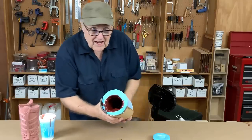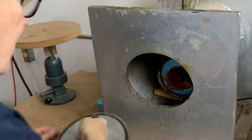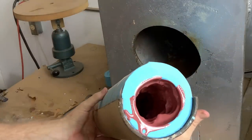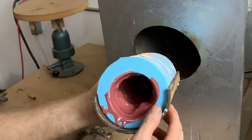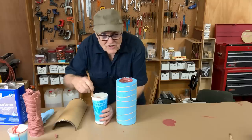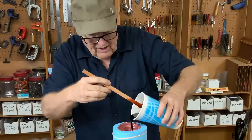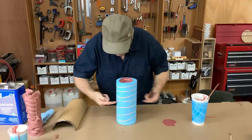Now we're going to run this into the tank. I simply laid the mold down inside the tank — I didn't need to deal with the vertical tank because this was rotocast in effect. I put it into the tank just to squeeze out any bubbles and to prevent any foaming. So now it's a simple matter of doing a solid pour, but I'm going to do it in stages because I don't know how much it's going to take to fill this up — I'll do it in two or three pours. They don't even have to cure in between. This is getting hot — let's pour it. Pull it up to about here.